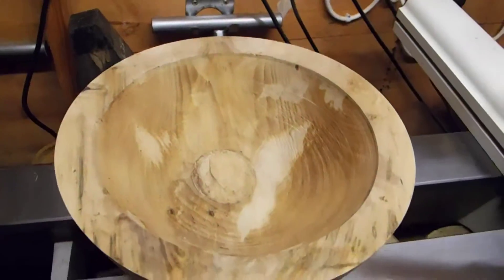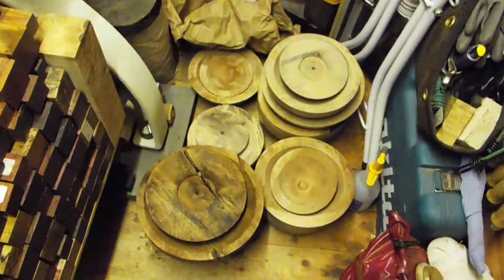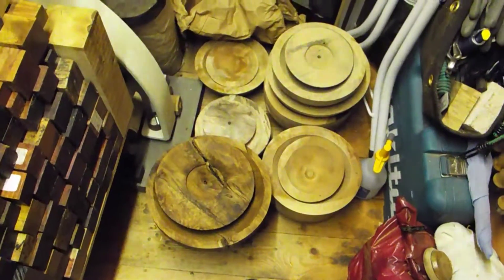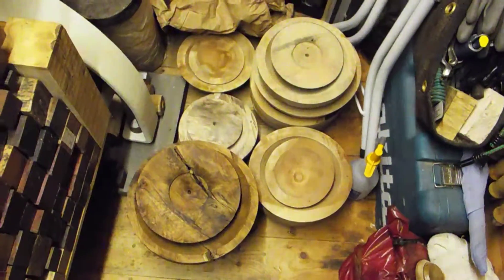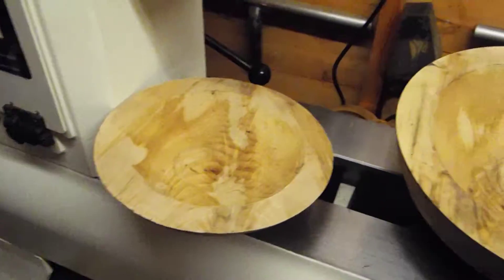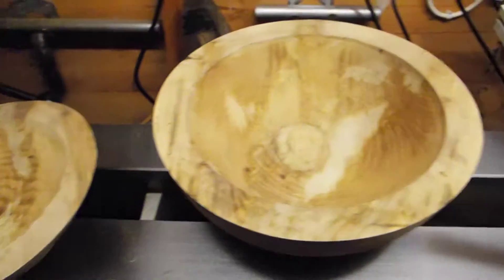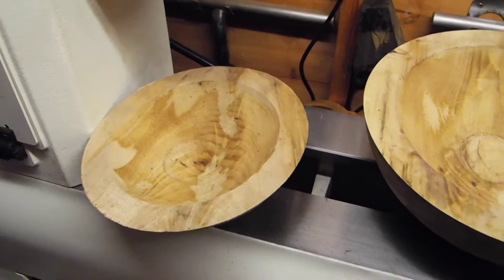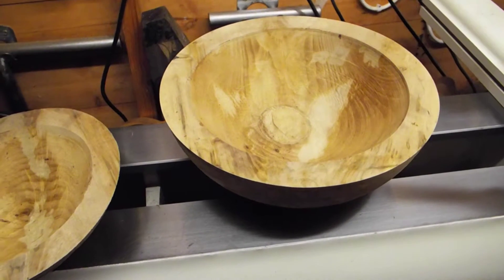Right guys, that's about it - that's some of the wood we've had drying for the last 14 months. It's not quite dry yet. I finish-turn at about 12% moisture, so it's going to take about another four to six months drying in my shed, which luckily acts like a kiln during summer and dries bowls out pretty quickly - but not so quickly as to start splits and cracks. Hope you've enjoyed looking at some of the wood. I'm sure you'll agree some of it is absolutely stunning, especially the crotch bowls. I've got plenty of ideas for future videos and I hope you'll join me. Thanks a lot for joining, take care in those workshops, see you later - bye bye.